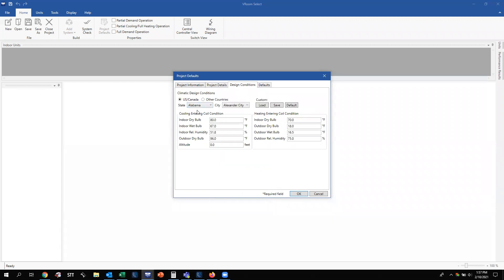The Design Conditions tab is the most important tab out of all four. This is where you set the design conditions for the outdoor unit design temperature and indoor/outdoor wet bulbs. If you scroll down to the Pennsylvania tab and pick the Pittsburgh area, it gives you a preset design condition. These are typical design conditions for this area. People were previously speccing the outdoor dry bulb at 89 degrees, but more recently most engineers are speccing around 95 degrees outdoor ambient. I always put 95 in there because that's what we're seeing more and more as far as outdoor temperature design conditions.